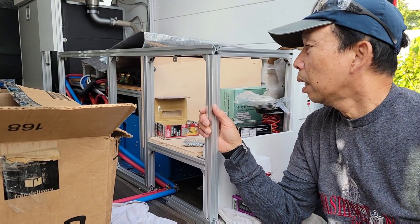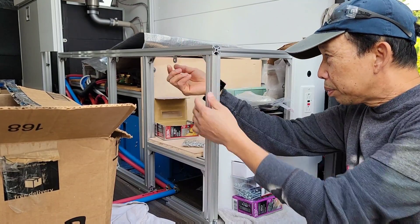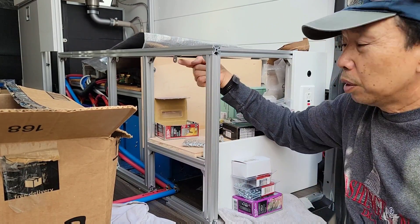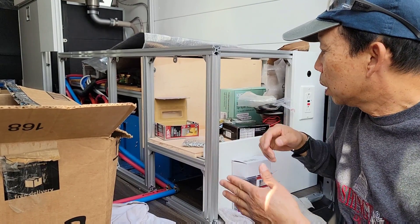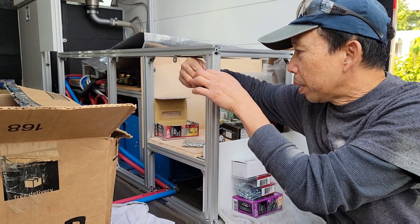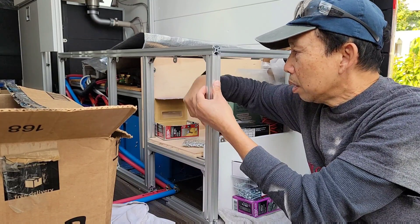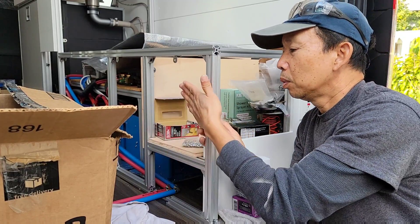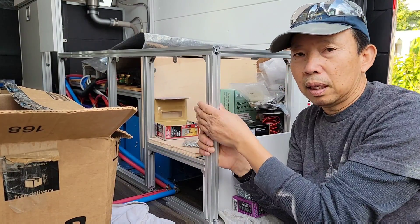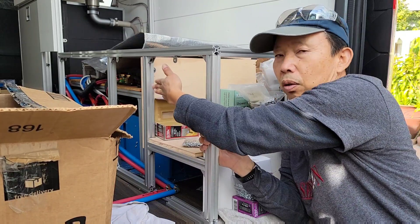That method is only for when you have access to screw the board from the inside — you put the angle brace here and screw it from the inside. But what if you don't have access from inside? Then you use the same angle braces to attach a wood beam across here, and then screw your panel into that wood beam from the front. That's the only time I put a wood beam across — so I can screw into it without drilling into the aluminum extrusion.